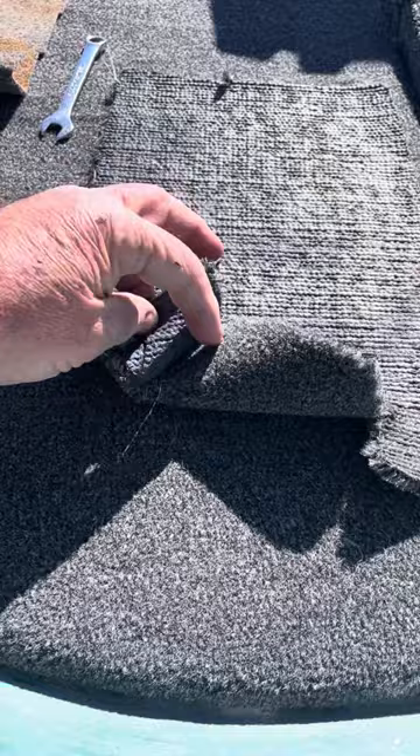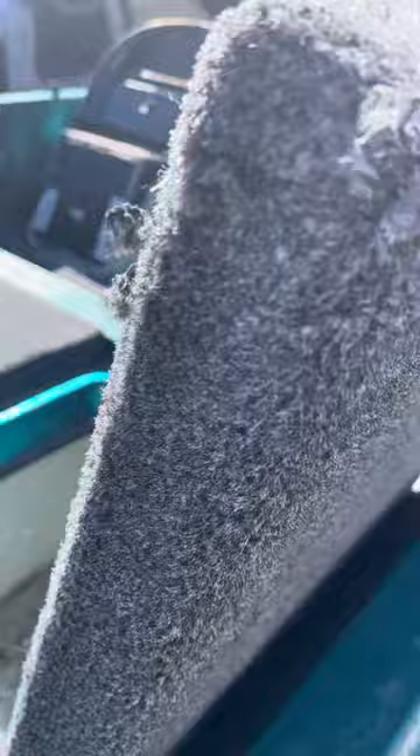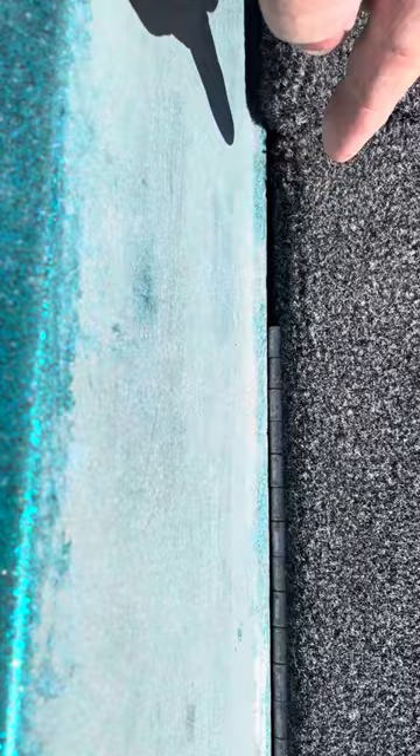That's going to be your seam right through here, just like this one right through there — that's the seam. Whenever you've got a hinge, you put the seam back on that corner so it's captured in the back. It's not going to pull out from anything.